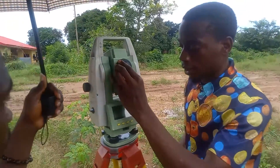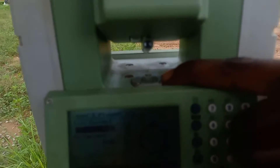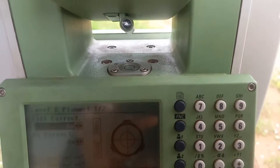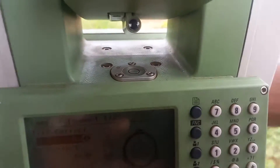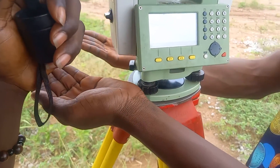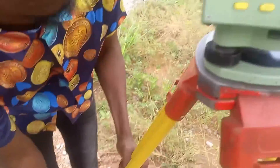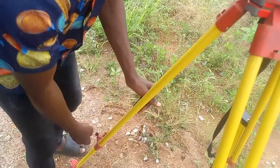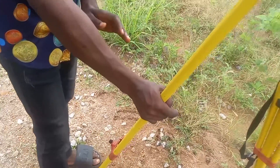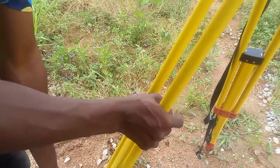The first thing you look at here — as you can see, the bubble is very close to where I am. That means this side is higher while the other side is lower, so it has to be raised up to make it come to the center. You have to grip the leg this way so there will not be free movement, then unclamp.